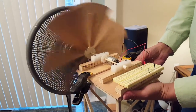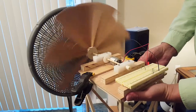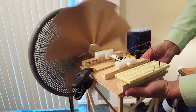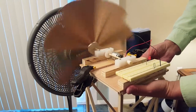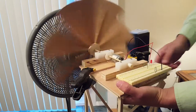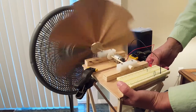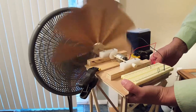As you can see, the fan blade is turning, but the LED is not coming on. Through previous experimentation, I found that this produces 0.5 volts and the LED requires 0.7 volts in order to light up, which is why we're not getting any output from the LED as a visual effect. So the wind in this case is not strong enough to produce electricity to the level that we need it. It is producing electricity, but at a much lower level.